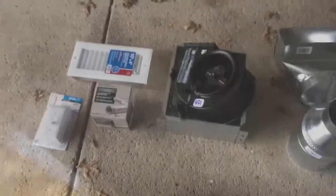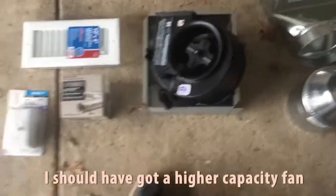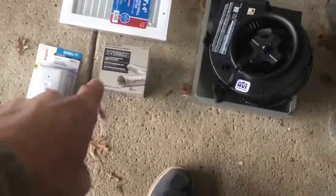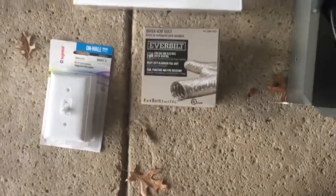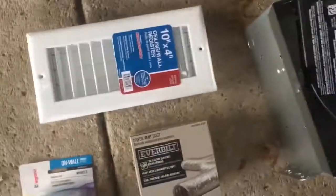Here's what I got: a medium capacity squirrel cage fan with no light, some ductwork, and I'm going to run some round flex duct — which really isn't for heating, but it's going to work for what I'm trying to do. Then I'll couple that into a reducer into a register. I have a register right there. I'm going to wire this into a lighting circuit I have up in the attic and surface mount a switch on the ceiling.